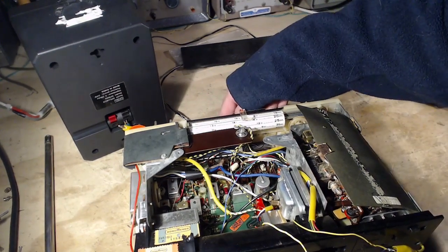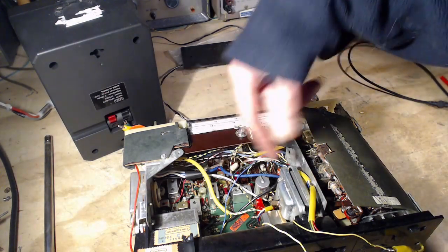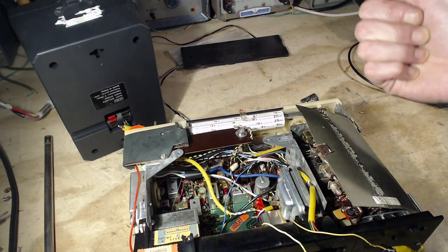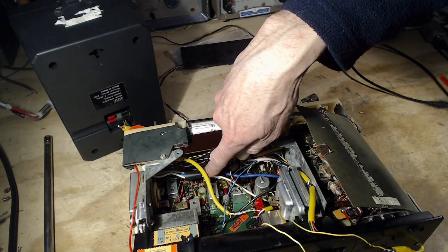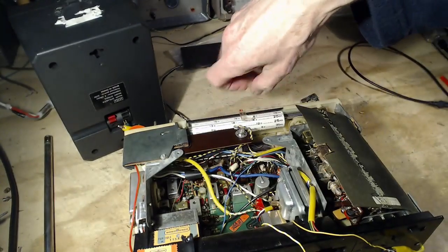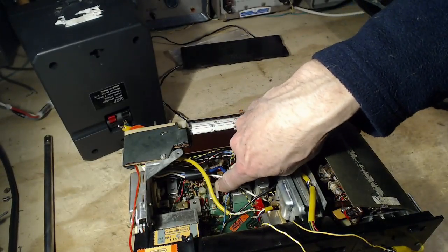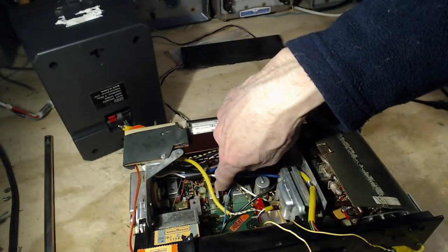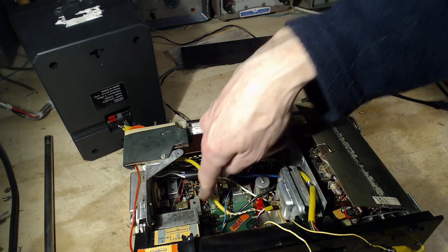Now, you can kind of imagine coming out of the push button then is the FM signal heading towards the FM IF amplifier circuits. I see a single slug transformer there, I see another one there. Double, double, double, and double. Single, single, single. Oh my gosh, there's so many of them. So a lot of radios you'll find these double IF cans. They have both the coils for the AM side and the FM side in the same can. But that's probably what we're seeing here, here, here, and here.